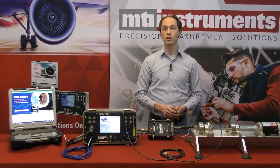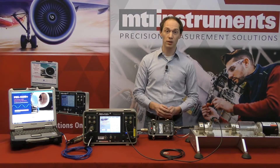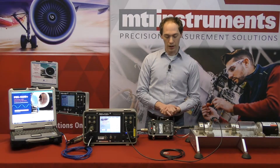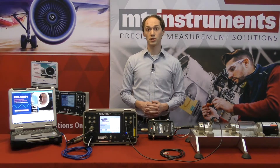In the real world these charge cables would be as short as practical. The charge cables run directly into an MTI 41CA charge amplifier. This amplifier turns the charge signal into a millivolt signal which is less prone to noise interference.